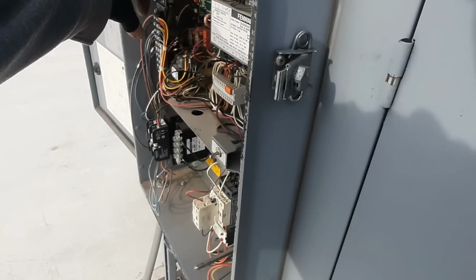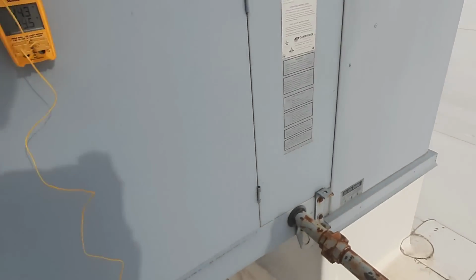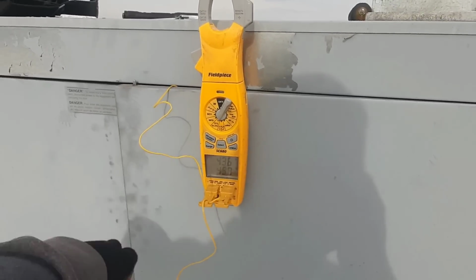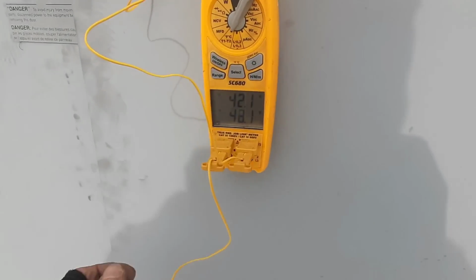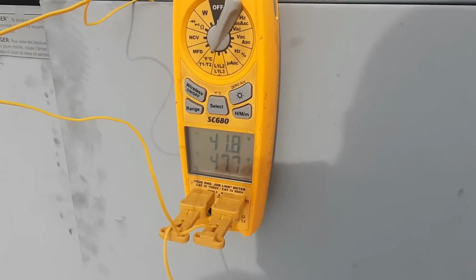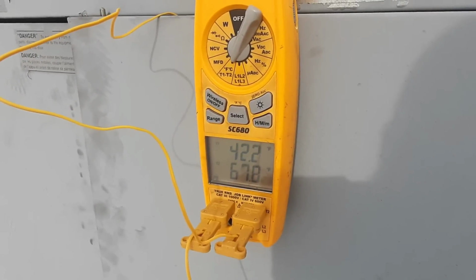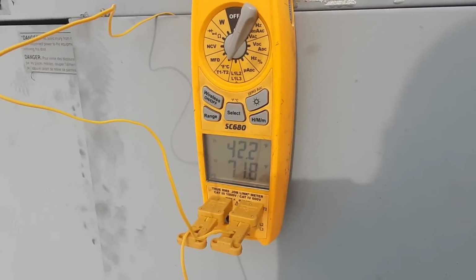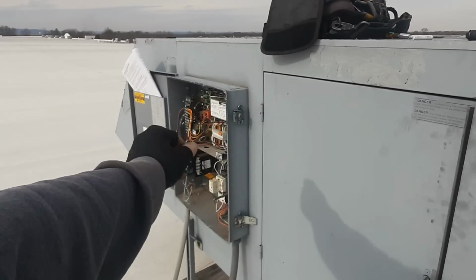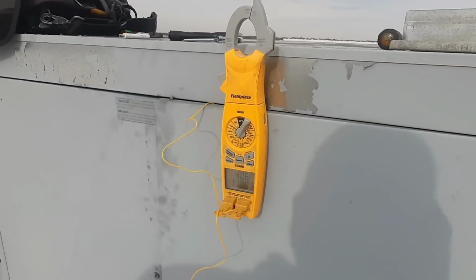We're just gonna kick it back in to remote and remote, and let it cycle off of the thermostat downstairs. And we'll be able to watch that burner fire. See what kind of supply temp we get. Now, I've seen it modulate by just adjusting that dial, so I've got it set back to 160. I'm not concerned about it modulating.